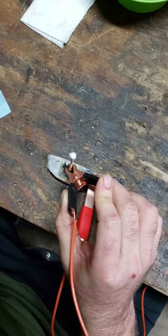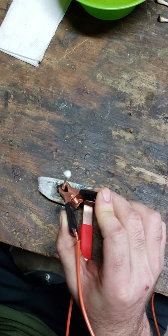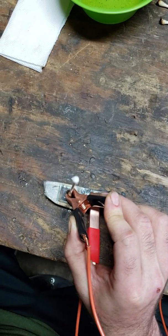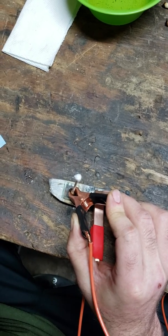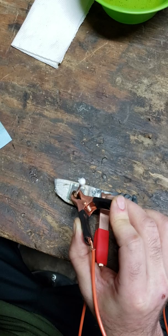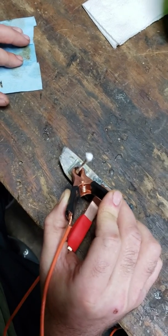And then after you're done with that, what do you have to do to the logo? I will remove my clips from the knife. I will take the tape and the logo off. You must take the logo and put it in some water with some soap in it, preferably warm water. You have to let it soak, and then gently clean it with your fingers. I would advise letting it soak for a couple hours and cleaning it several times. That will open your mesh back up and allow you a much better etch the next time you use it.